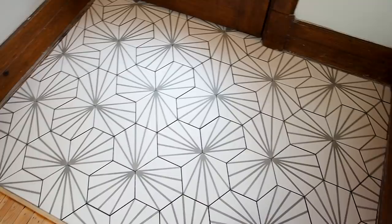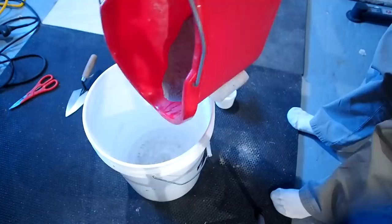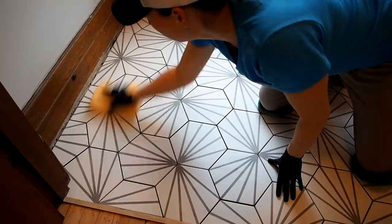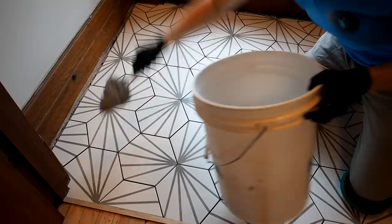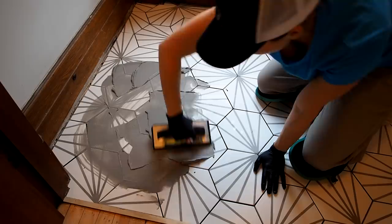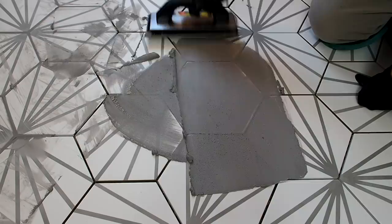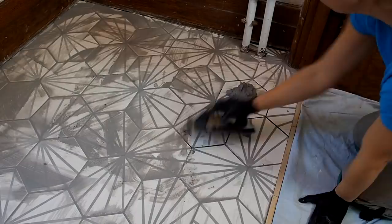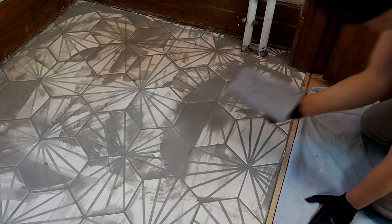I let it set for 24 hours, then got to work on the grout. Just as I had done for the thinset, I weighed my grout powder and added it to a bucket of clean water which I had also carefully measured. I mixed up the grout for a few minutes and immediately got to work. Working one small section at a time, I first used a wet sponge to wipe down the tile, then dropped on a small amount of grout and started working it into the joints using a grout float. Since the joints in this tile run in all directions, I ran my float randomly in all directions, back and forth, to force the grout into all the joints. Once done with a section, I dragged the float along the tile to remove as much excess grout as I could.